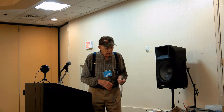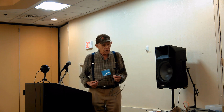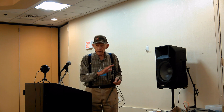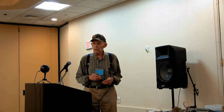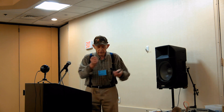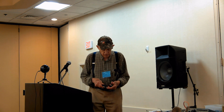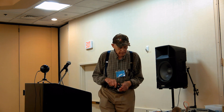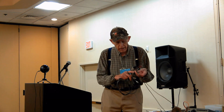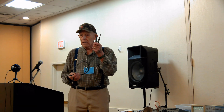We'll actually test that when we're looking at the radio. You'll see that when you apply the scope probe, it hardly makes the radio twitch. It doesn't change its waveforms at all. And that's a very important thing about these probes. Now, some of them come with a switch on them, like this scope came with a switch probe, the little black switch, which changes it from times 1 to times 10.